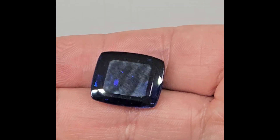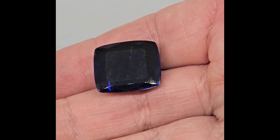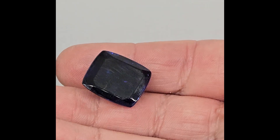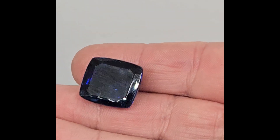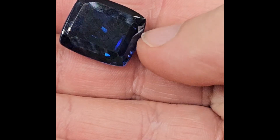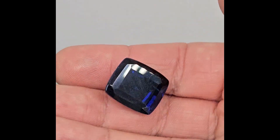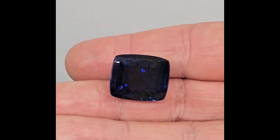Here's the next approach — the table is a little more lowered, but the stone is still too dark. Next step, we go down even further, but the color is still not light enough. To get closer to the final look, I also cut the four facets that surround the table, using the same 3000 diamond grit. The final polish will be done on 60,000 diamond, but the color of the stone can be seen good enough without the final polish.